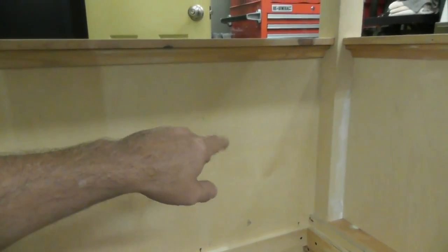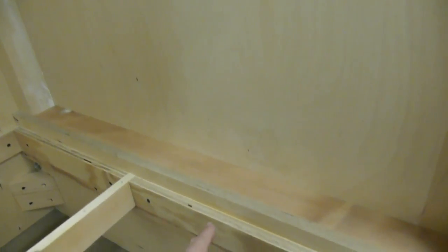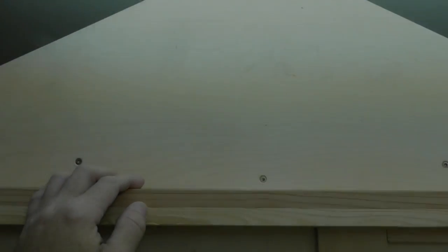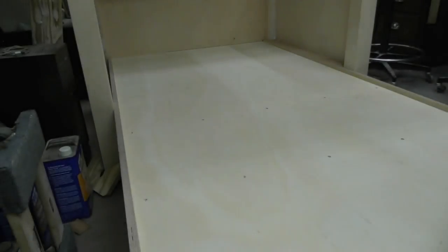I've got my headboard and sideboard reinstalled. I took them out to round the corners over on the plywood as well as glue the cap and the cove on. Everything's looking good — I was going to put some screws in to support this piece but after gluing everything up those aren't even required. I've got both peaks screwed on; I made corner braces to draw these corners up tight. The block is screwed and glued to the upright, and then a single screw draws everything together.